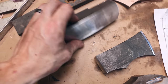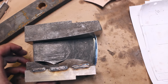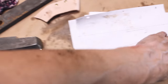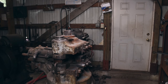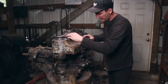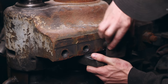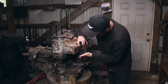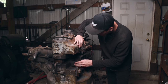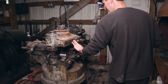That should be done. Pretty excited to get that in the upsetter and try it out. Just going to check it here one more time — that's all going to work in like that essentially. Looks good, I think we got it. Let's put it in. I'm just over here at the upsetter to get this tooling in. That shoulder there — this part sits like that, and then this clamp is going to come on top of it, right like that. I just need to machine off this part so it sits at the right height — we'll cut it back here. I'll measure that out and go from there. Got these guys all trimmed up, and now we're just going to see how this all works.